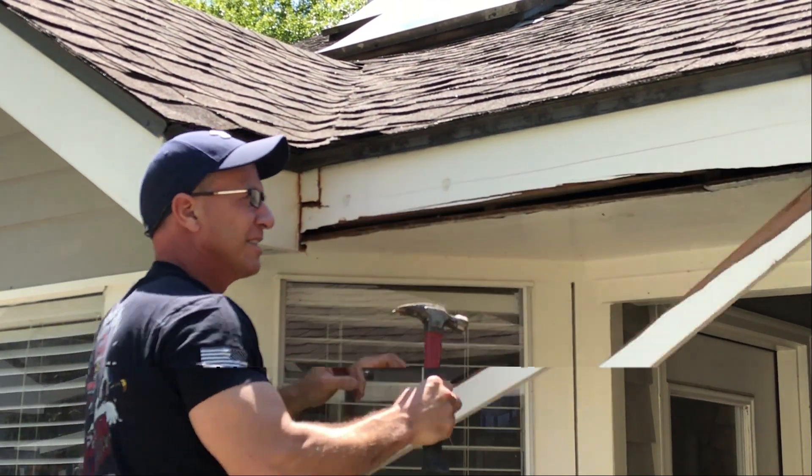Take my screw out from up top — two tiny little putty holes and we're done. This is where you're going to be separated from the average DIYer. The average DIYer — or sometimes even a contractor — would just caulk this gap. I'm not going to do that. The reason I have a gap at the bottom is because there's a slight crown on this board and you can't force it in at the center. So what I'm going to do is cut a one-and-a-half-degree angle — it's going to be a little bit longer at the bottom than the top, and that will close this gap when it's all put together. I'll set this at one and a half degrees, then set it back at 45 degrees, lock it in place, and make a quick template.